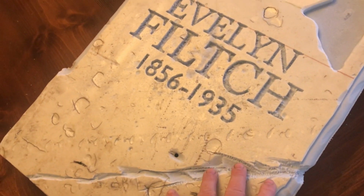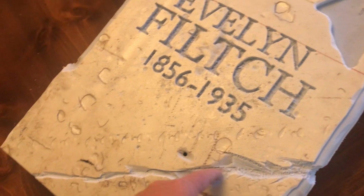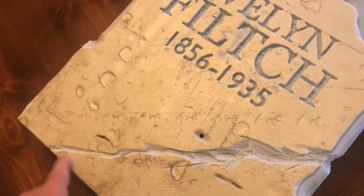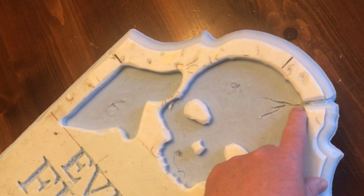Because these are usually made out of granite, they don't crack with like a perfect crack in it. Usually when a crack goes, you'll have like a hairline crack, and then as the water gets in, it'll flare it all out and break it. So that's why I went with this. And I went right through, because usually a crack connects. Very rarely do they start and end. But I did one of the start and end cracks right here.